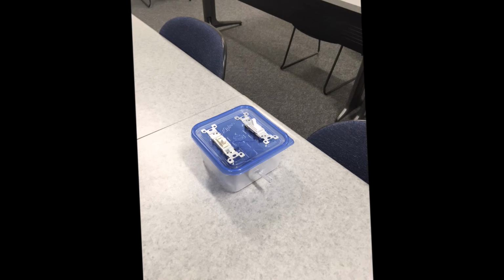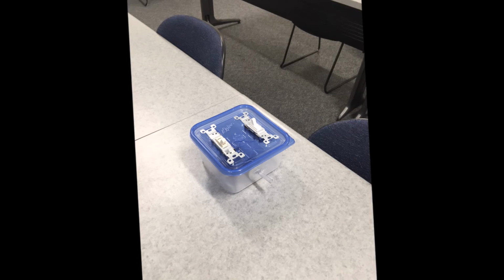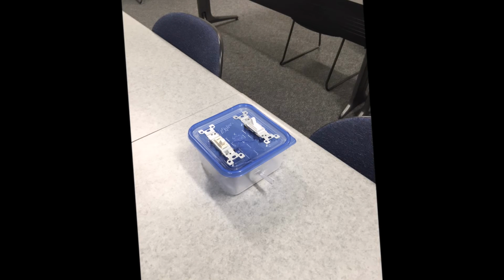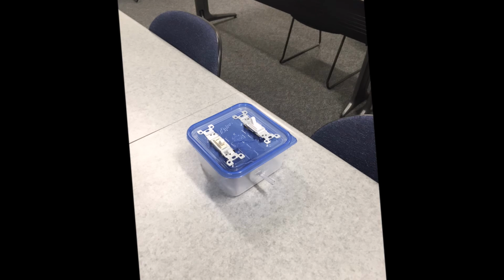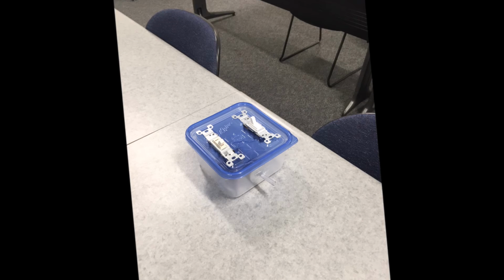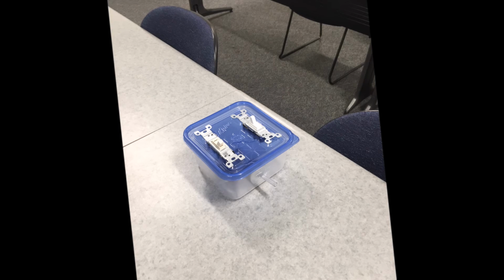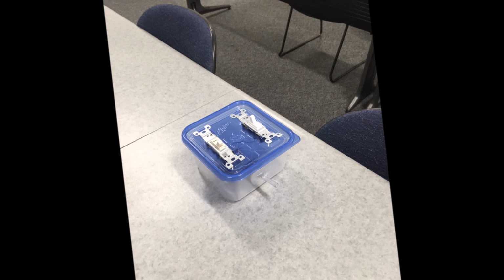A few things we learned from doing this project are we much better understood how a coil of wire can have an effect on a projectile inside of a barrel, and we also better understood how capacitors work, how they can store up a tremendous amount of charge and voltage on such a little device. We also learned about circuit boards on a disposable camera. We had to figure out what actually did what on the circuit board, as in what discharged the capacitors and what charged them, and then we had to wire all that up to our switches and get all that working. So overall we learned many things, and it was all applied physics that we learned in class.